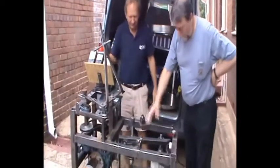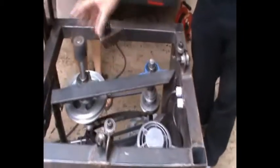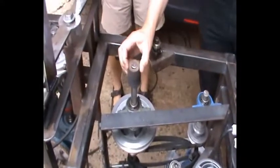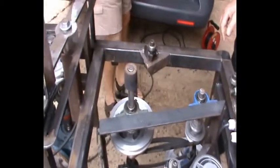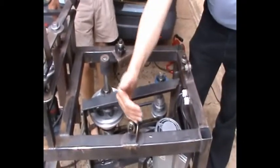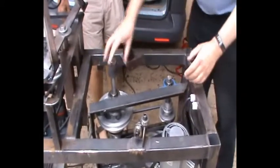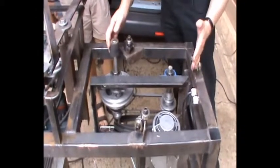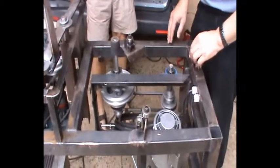This motor drives through the pulleys to this spindle. The spindle is encased with rubber which is a bit squishy, and this will then run on the inside of the rim of the table. The edge of the table sits on these and is constrained to operate only in one plane. As this spindle biases it outwards, it pulls in against these pulleys here, so it can't move laterally.